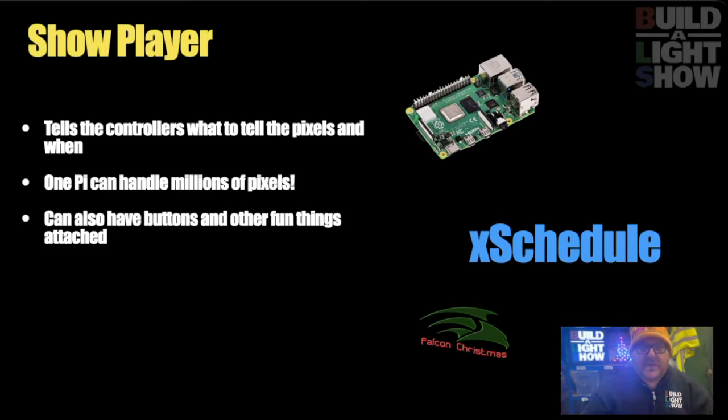You can actually right now map out your entire show with what lights you want. You can upload a picture of your house and put it over without buying a single thing — have a play with it. We're going to have a full video soon on running through Xlights and doing a demo house. You'll need a network switch — just get one. They're about £20 on Amazon; make sure you get one with gigabit. You use Xlights to create something called a sequence file, which is a package of not only what the lights do, but any video, any audio, all in one. That gets sent to FPP — Falcon Pi Player — which tells the controller what to play and when, what colours to tell the pixels to go to. Everything is managed from the show player, and they're all connected by the network switch.